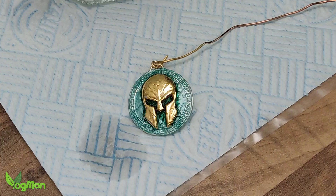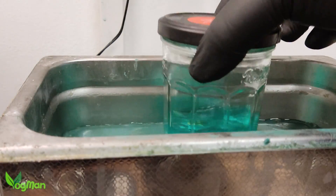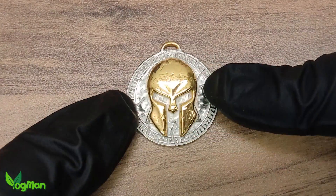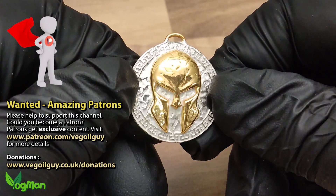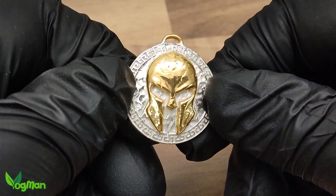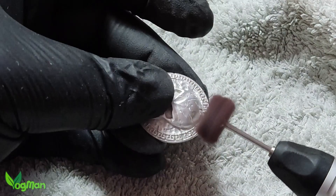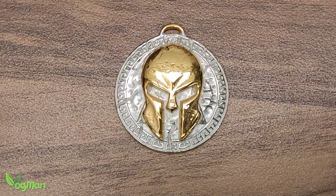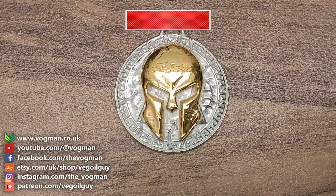That, to me, looks great. To remove the nail varnish I used ordinary acetone, which gets to work straight away. Two minutes in the ultrasonic cleaner was all it needed. Another rinse in distilled water and here it is – and I'm thrilled. This really was surprisingly easy and I think it looks great. What a difference this is going to make to my metal casting ventures. There's a small area of gold around the hoop that has plated, but metal plating is microscopically thin and we can quickly remove unwanted patches by machine polishing. But I like it as it is and I'm going to leave it alone. Gold plating at home with a Pepe Tools plater – I hope you enjoyed this video. Take care and thanks for watching.